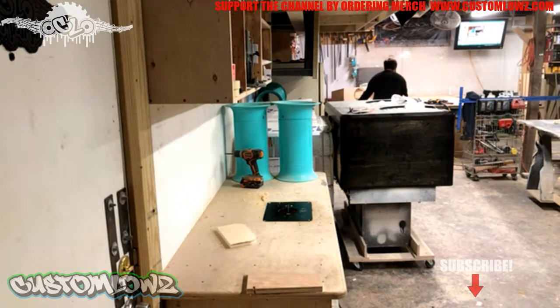We're going to leave you guys over there for now because I'm basically just going to be prying this piece off of here and sticking it on top of our next area I got to cut out. And you probably could jigsaw this in the same amount of time, but my concern is that I really want all the holes and the cutouts to be as similar as possible. And also, you don't have to worry as much about messing up if you cut one to the best of your ability and then use that as a template, basically.